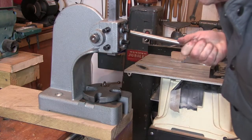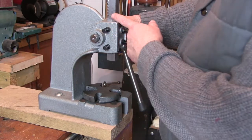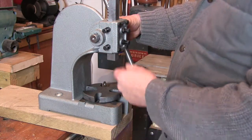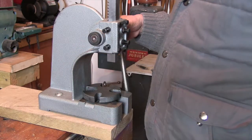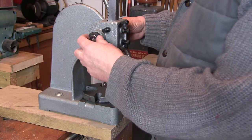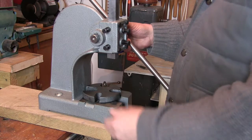If I'm sitting down here on my stool and you want to be able to move the handle - I know there's a hack where you take the bottom two teeth out of the rack, but I don't really want to grind the teeth out. So what I've pretty much been doing is: this collar that holds the gubbins that moves the rack up and down just goes on there and is held on with an allen screw. I thought I might try and make that easily removable.